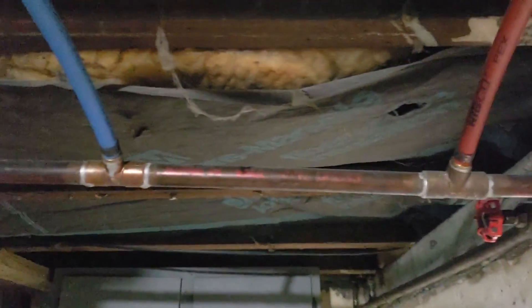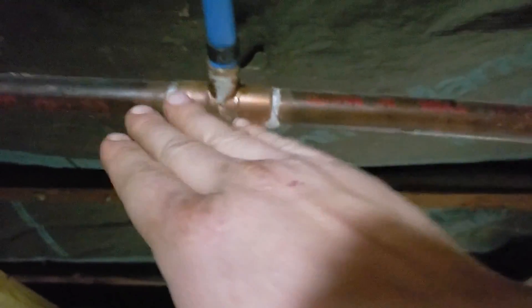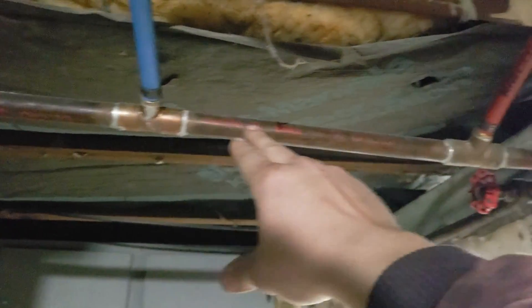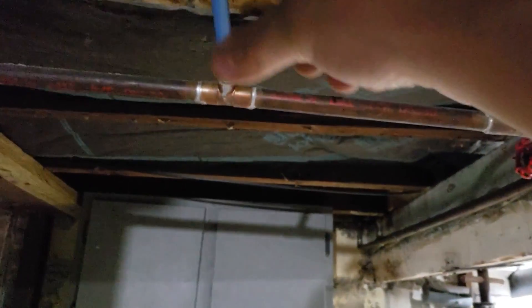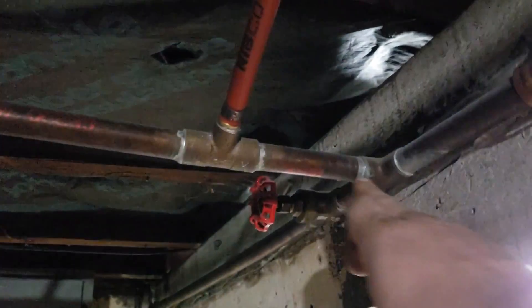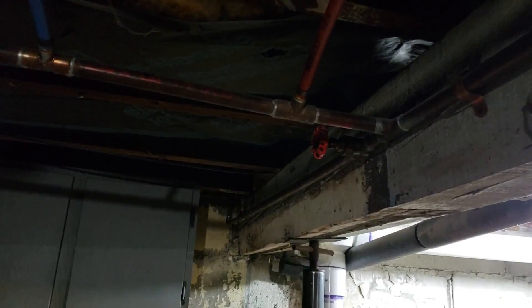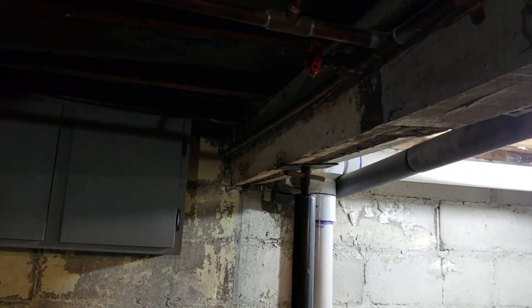This is my main water line to the house, and you install these T-fittings. They have a little diverter in them and it diverts half of the water one way and half the other way. So half of every gallon that goes through the house will go through this line, through my preheater, and then come back. The other half just goes straight through — so you don't lose pressure. That's the reason why you do this instead of just putting it all through a half-inch line, which would cause a lot of pressure loss. This keeps the pressure really high. It basically warms up every gallon of water that comes into the house. It helps with the water heater, helps with laundry — it's just better to have your incoming water warmer than coming out of the ground at 40 degrees.